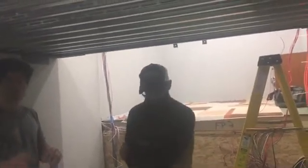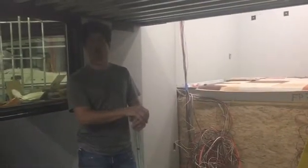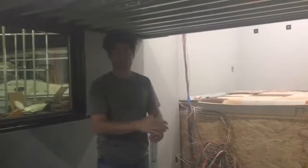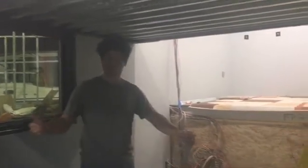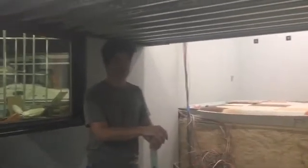It's actually aluminum SIP panels, so it's a 30 thousandths thick sheet of aluminum. It's got aluminum skin on it, the same EPS core, just with two aluminum skins, and they're ridiculously light. I actually installed the roof single-handedly, just by myself, on a ladder. They're bulky, but they're like 25 pounds a piece. It was crazy how light it was.